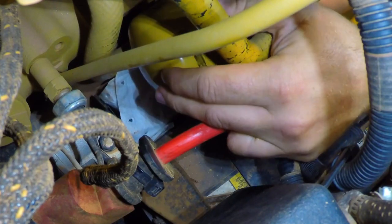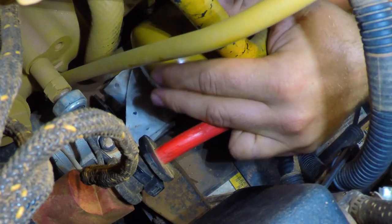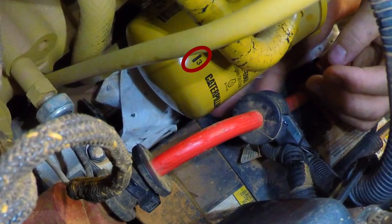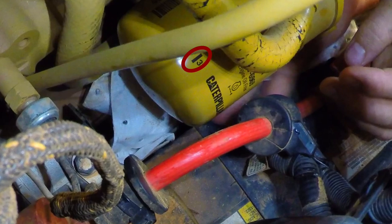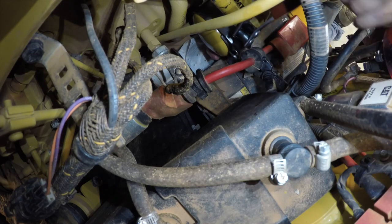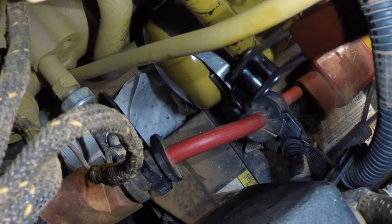These rotation index marks on the engine oil filter are spaced 90 degrees, or one quarter of a turn, away from each other. When you tighten the filter, use the rotation index marks as a guide. Tighten the filter according to the instructions printed on the filter. Use a CAT strap wrench or other suitable tool to turn the filter to the amount required for installation. Make sure the installation tool does not damage the filter.